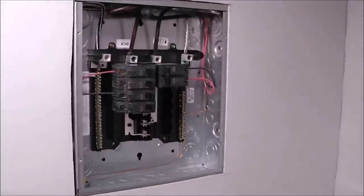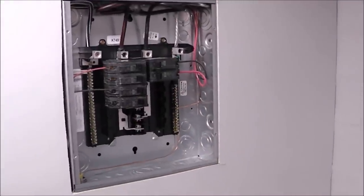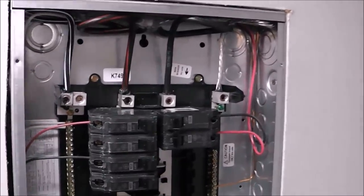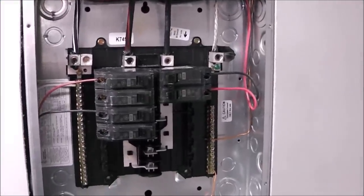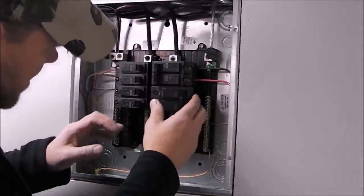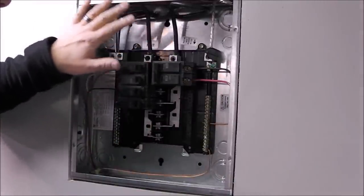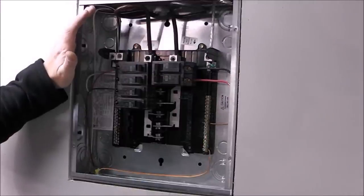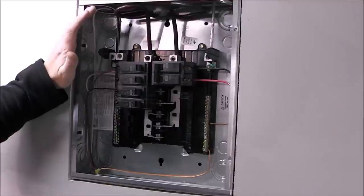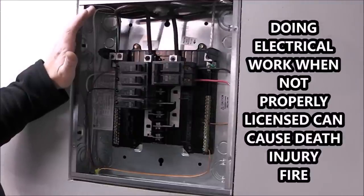Here's a shot of the electrical panel and the outlet below it — you didn't see it in the last video, but I'll put a card up if you want to take a look at why I did all this. This is the sub-panel inside my workshop. The first thing we're going to do is snap in our 30-amp breaker — but actually, the first thing is to make sure this panel is completely powered off and verified dead. I'm not advocating you do this yourself; if you're not sure, go get an electrician — that's the best way to go about it.